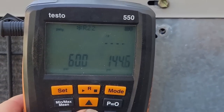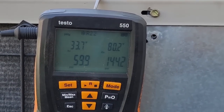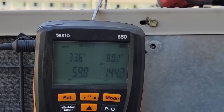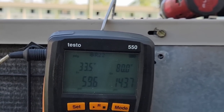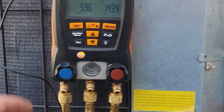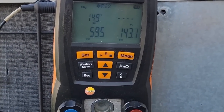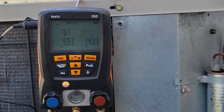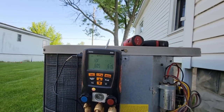We are looking a lot better. Generally your superheat's going to be a lot higher in this colder weather based off the wet bulb, but it's looking much better. I didn't remove much and it holds there — I am happy. 33 degree evaporator, we're not running under freezing, especially with the house cool and outdoor ambient at 59. Superheat hanging in there at 14.9 — I'm going to say we are good. We'll dump back what we've got left in the hoses, it's come back down around that 12 mark.